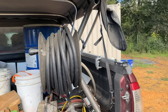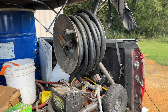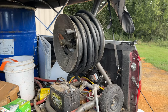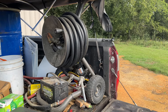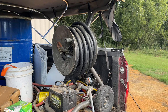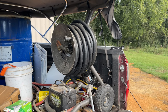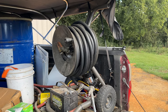Syrup comes into the pump, through the pump, and into the inlet for the hose reel. This hose reel is actually the most expensive part of the system. That is an ELEY garden hose reel — it's all aluminum, high quality. It's $321, and it's probably the best garden hose reel I found on the market, but it is not as good as an industrial hose reel. The fittings are only five-eighths of an inch and the hose I'm running is three-quarter, so I'd rather have three-quarter or one-inch fittings, but it was three to five hundred dollars cheaper than an industrial model.